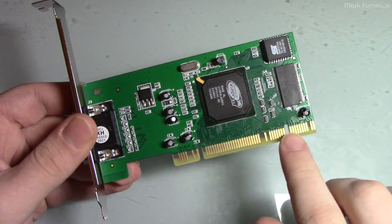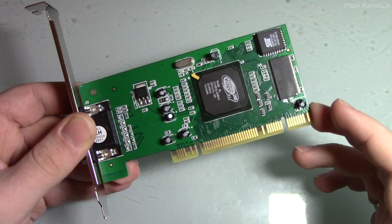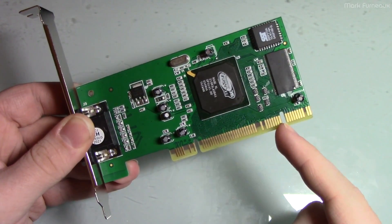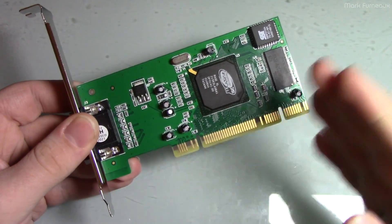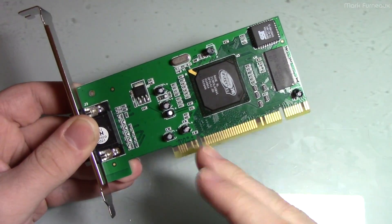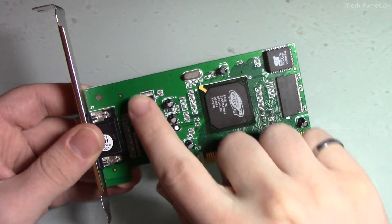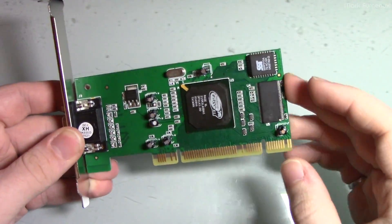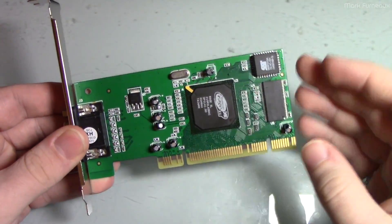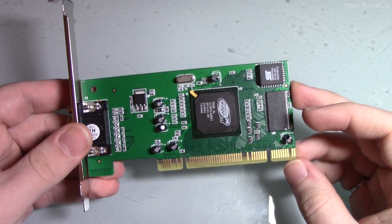So it's kind of sketchy. I know why they put this slot on here — because if you take a look at any PCI slot from a modern motherboard, they only have the divider for one voltage, not both. In the later versions of the PCI spec, they deliver both 3.3 and 5 volts even with only one divider, so you don't usually see both in the slot. Anyway, this card doesn't work in that slot, and so I thought, well, I could return it, but they're all the same — so I thought I can just modify it, I can easily retrofit this.